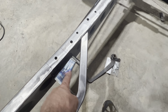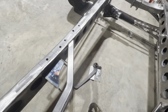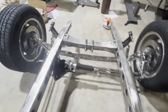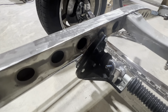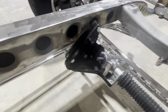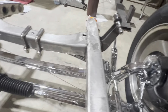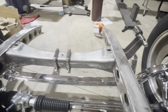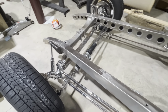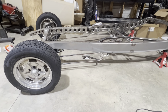I think I did the measurement right for that. This bar right here is going to have to be cut and angled somewhere back behind where you see it right now, because the pedal is going to be right in the way. The steering is the Unisteer unit. I decided I was going to put the Vega steering box mount on and then mount it to that — I didn't want to just weld the Unisteer mount onto the frame, because then if I want to take it off, it's easier to drop the three bolts. The shock mount is Pete and Jake's — that's Roadster Supply — holding the spring on. I think it's a Posey's spring with a super slide type deal. Chrome as much as I can. I like the Curtis style hairpins that are straight. So that's where I am so far.